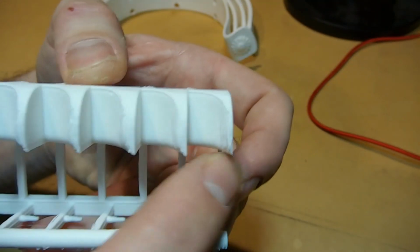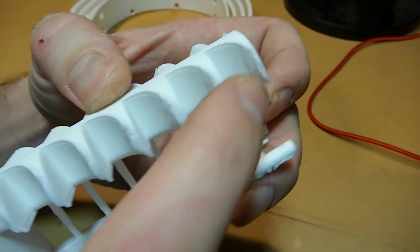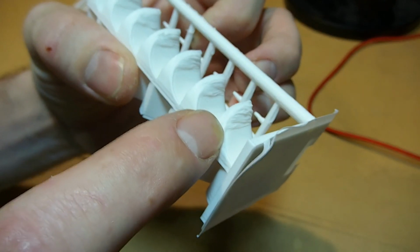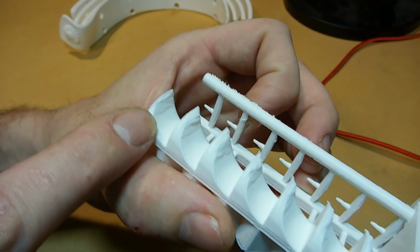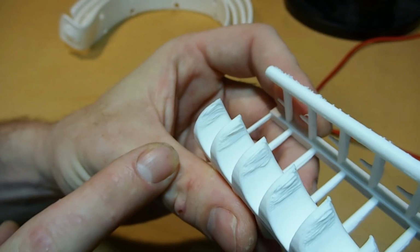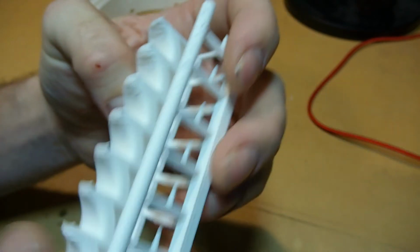So if we look here at the very top one, it actually fails much later than we do further down here. If we look at the, what is that, 210? I don't know if you guys can see that very well, but we actually have some pretty substantial errors in those overhangs. As we move up in temperature, though, you can see here at 180 that this is looking pretty good. I wouldn't be super upset about that. And we're really clean up until we start having issues.